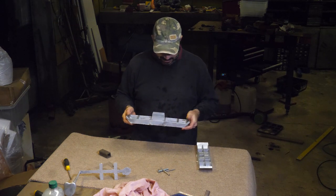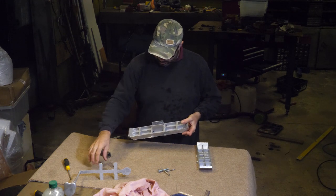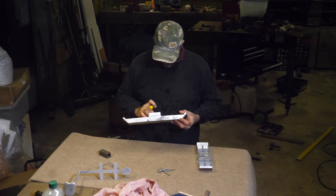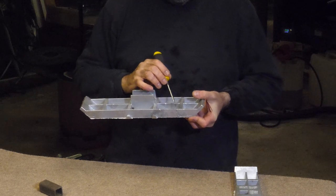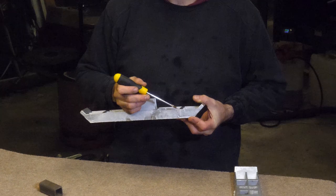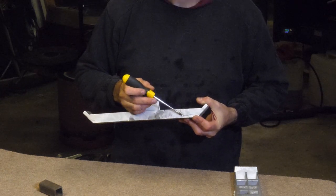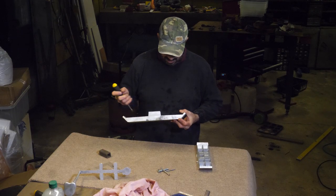I think I need to have a slightly faster pour. I think that's what's happening here. I think it's a little cool, and the wave fronts of aluminium aren't joining properly there because of the oxide. The layer is just freezing before it even squidges there.